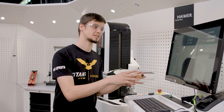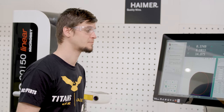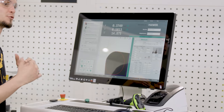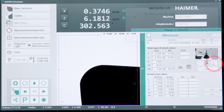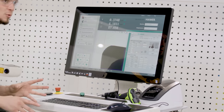Now that I have this set, I'm going to replicate this five times because I have five cutting edges. To do that I simply come up to this corner and click apply, because this is the window that I want the machine to find next time. Once I have this cutting edge I will simply go over and click this arrow where it will go through and automatically try to finish my process for me. But we have some debris on the tool.